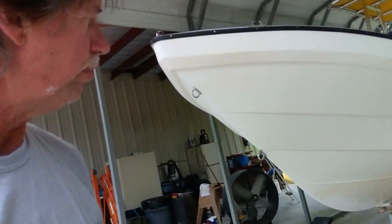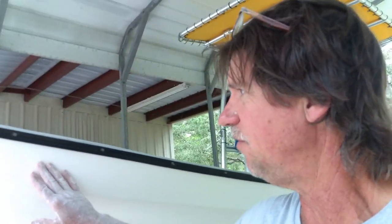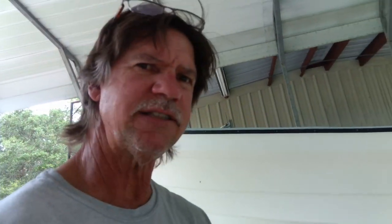I've got one more little patch I made yesterday — you can see it right here. It was just a little chip; I've got to sand that one off. I'll also clean up around where these scuppers were. Anywhere there were stickers — this is where the Panga USA sticker was and my FL numbers — anywhere there are stickers like that, spend extra time because you can actually feel it. Where the sun doesn't shine on that it gets into the gel and you've got to sand extra, because it will actually show through when you're painting.